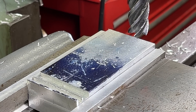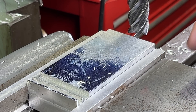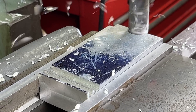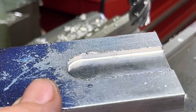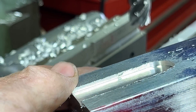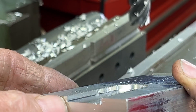Now I want to show you one last thing — I'm going to make a slot. I won't go all the way; this is a three-quarter inch cutter going 100 thousandths deep. You will probably find that on one side of the slot the finish is better than on the other side, because in effect one side of the slot is conventional milling and the other side is climb milling. Looking at the slot, the far side here is climb milling — I'm talking about the side of the slot — and then on the other side is conventional milling. You can perhaps see that it isn't quite as good, though it doesn't show up too dramatically here.